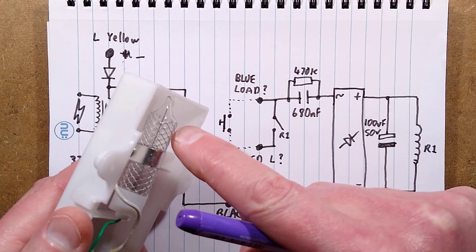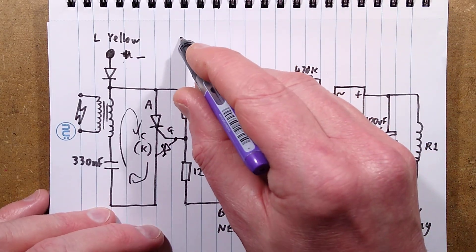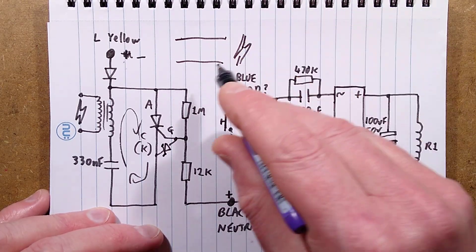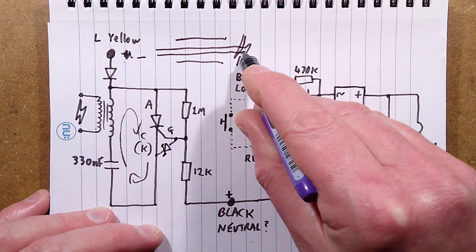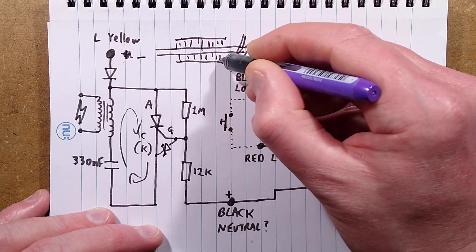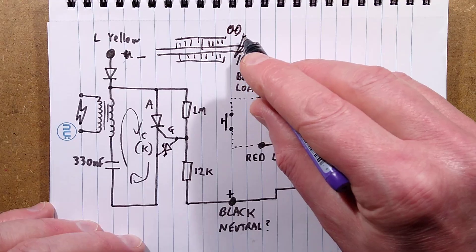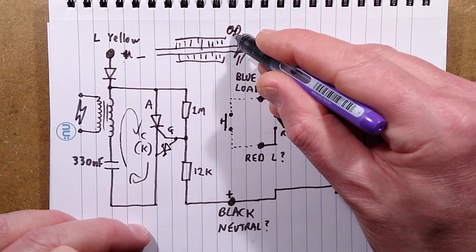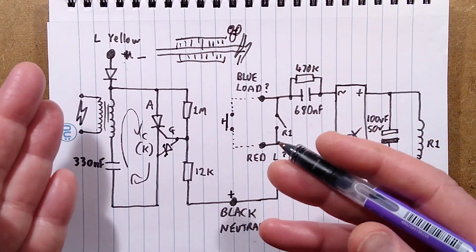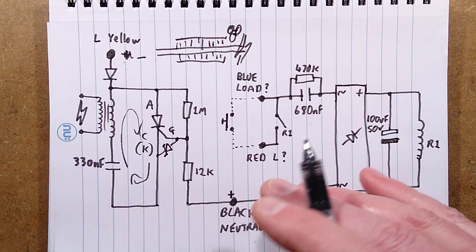Current is coupled via the gas to the outer mesh. If you have two electrodes and apply a high voltage, a spark will potentially jump across them. If you put a dielectric barrier in between that stops it, then with AC or pulsing current you end up with streamers of tiny little sparks — a corona discharge. When oxygen O2 molecules go in, the discharge can split them apart and some recombine as O3, a molecule of ozone, which is a short-lived unstable gas that oxidizes everything — it makes a bleachy smell and kills everything including viruses. This may be out of a sterilization chamber of some kind.